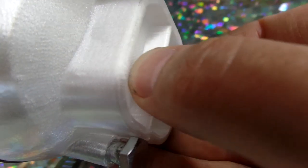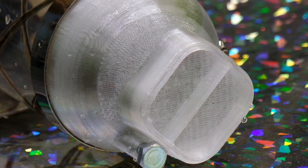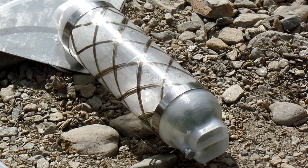Time for a pressure test. It turns out it doesn't hold pressure. So I melted some paraffin into the little holes in the 3D print, and that seemed to actually hold water. Here I am doing a dunk test just to make sure I got it. I really like the look of the basalt fiber here — it's interesting how the plastic turns reflective. Total internal reflection kicks in when the light rays bounce off of the air layer inside there, but not the basalt fiber.